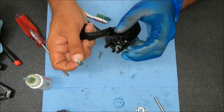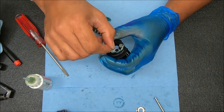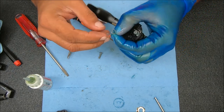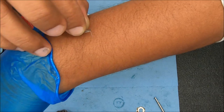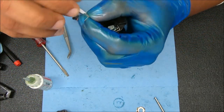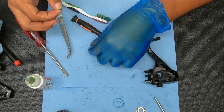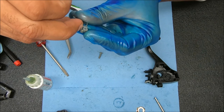Now for this section, we're going to have the lever in this open position because we're going to be wrapping it around it, so we want room to clear. The first thing I'm going to stick on is this spring — you'll notice there's a straight edge there and there's a hooked end right here. That hooked end will be going around that area right there, that corner.